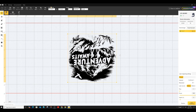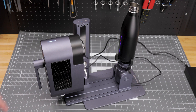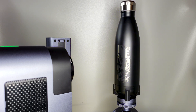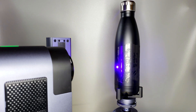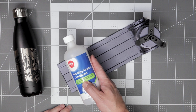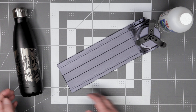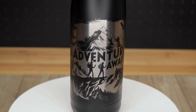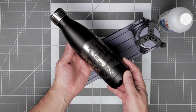For settings to remove the coating off this water bottle, I'll be using a resolution of 2K, the 450 nanometer laser source, one pass at a power of 100 and a depth of 5. I'll give this a quick preview to make sure the preview line fits within the area that I want to engrave. After the engraving process was done, I gave the bottle a quick wipe down with rubbing alcohol and a paper towel to clean up any soot left behind. Once again, I'm quite pleased with how this turned out — the LP5 did an excellent job of getting this design onto the bottle, and the results look very crisp and professional.